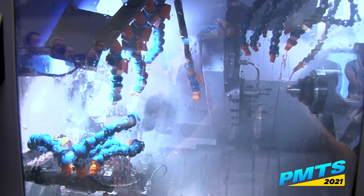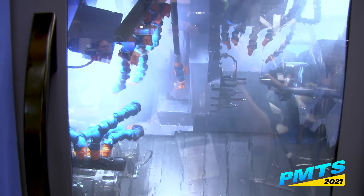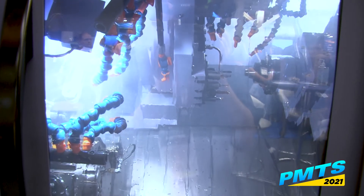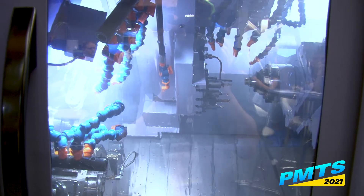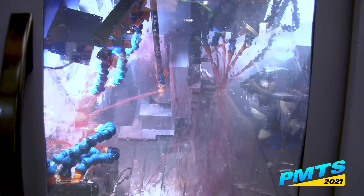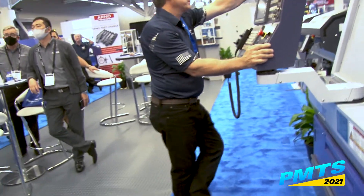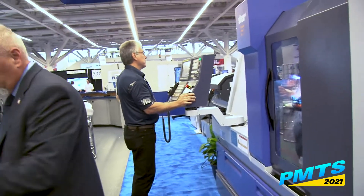On this particular process, we're demonstrating pinch turning — that's what we're doing right now. It's a little smoky, but your gang slide is coming in from the top and the turret is on the bottom, with both tools in the cut at the same time doing pinch turning. One nice thing about your Z3 axis is you're able to adjust how much your rougher is taking off versus your finisher. We have about 25% rapids right now. You can see the B-axis moving — the full zero-to-135-degree B-axis at work.